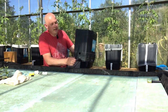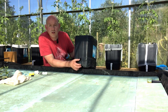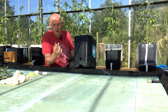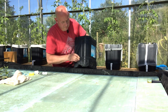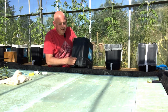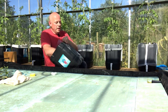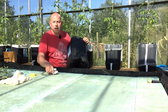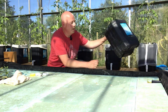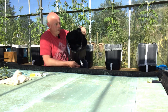After that, the next job is to take a 1 inch hole saw and just make a hole at the front. We've done that about 2 inches up from the bottom, just so you've got a nice reservoir in the bottom for the water. Then you take your rubber washer and feed that into there — that makes a nice solid seal, nice and tight. On the inside, push it through until it comes through the outside, and then put the other elbow on there to make the connection. You end up with a container that has an elbow on the outside and an elbow on the inside.